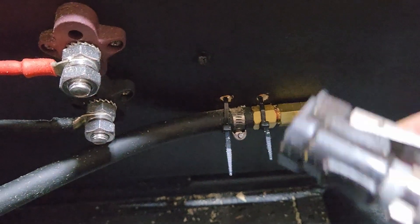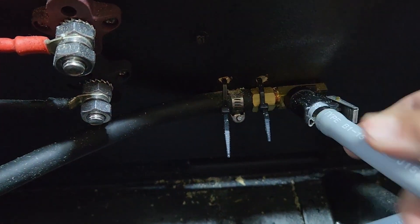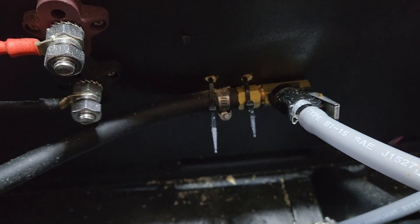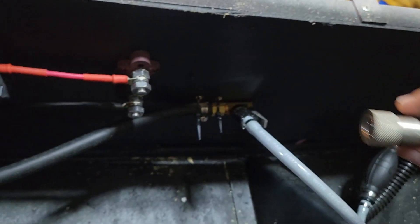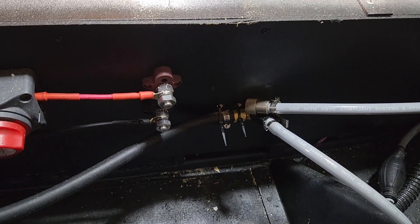We've got this Johnson component in here, which happens to be what matched the hose that I already have. That goes all the way on — nice and snug. Then we cut off the end from the other hose. This goes to the Tohatsu motor. All this fits and it is 100% functional. Let's go ahead and take a look at the fuel filter — we've got some really old gas in this tank, but it won't be such a big deal to get all that stuff cleaned out.